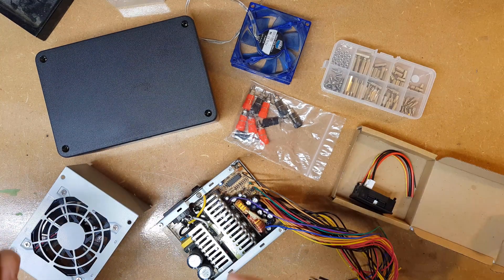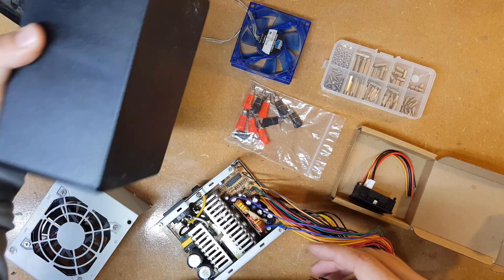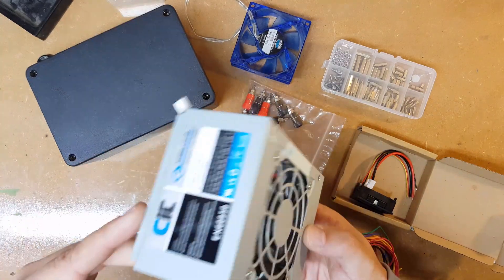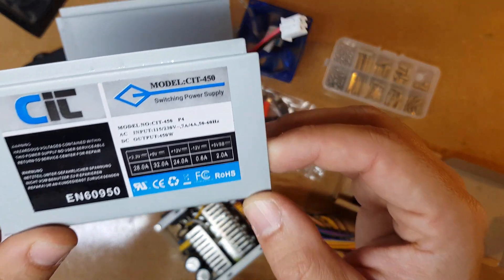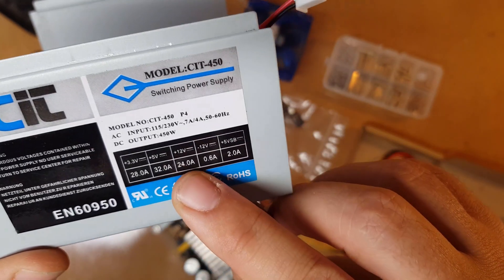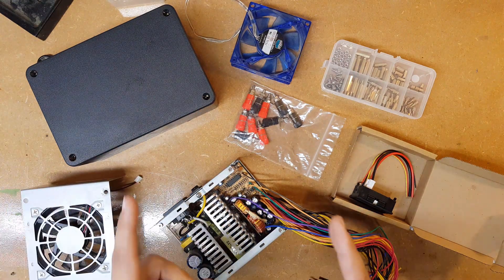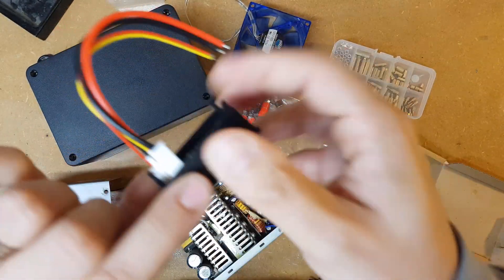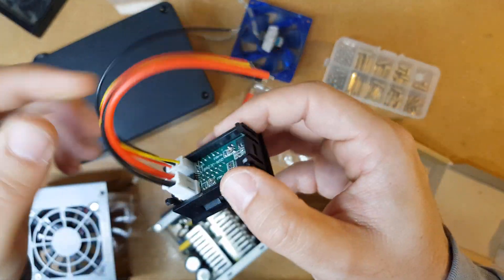I want to use that one back out here because it's got 5 volts and 3 volts out of it, whereas I want to make a dedicated one for the sim wheel using this natty box here and an old power supply I've had kicking around from an old HTPC that I built years ago. This is a 12 volt power supply that can supply 24 amps. I don't think the wheel will consume anywhere near 24 amps, but to find out how much it does consume I've bought another marvel of eBay and Chinese manufacturing - a voltmeter and ammeter in this natty little digital gauge.